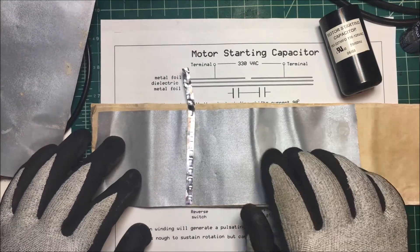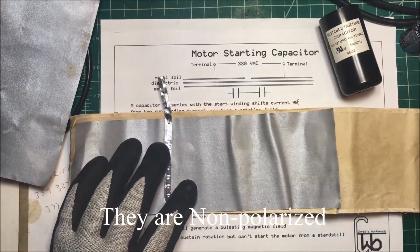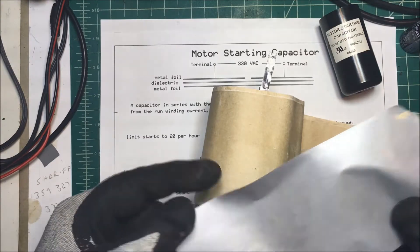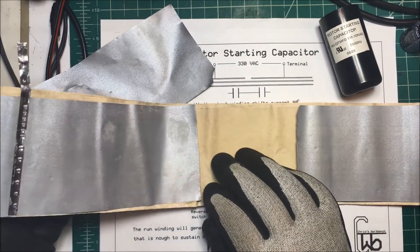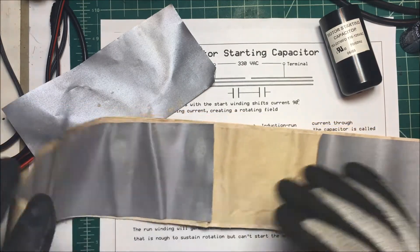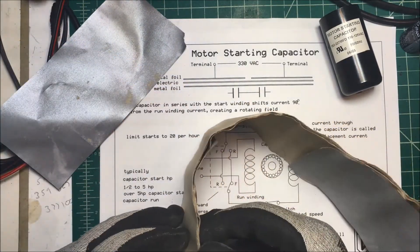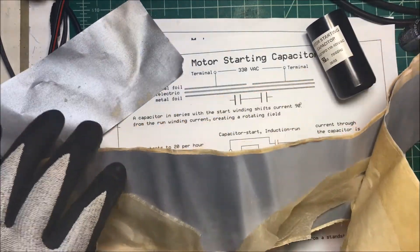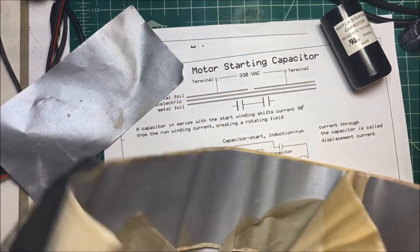These are non-polarized capacitors, so you put AC through them. Here's one plate and here's your other plate — it's just a piece of aluminum that looks like it's got oxide on it, and it's a fairly heavy plate. These are the AC terminals. They have another plate on the bottom side — there's some dielectric material there — and that plate is continuous, going past both of the two plates.